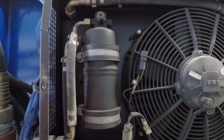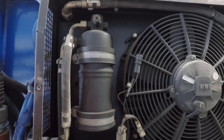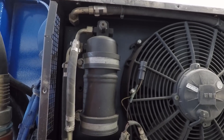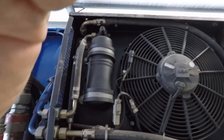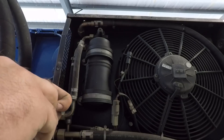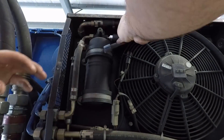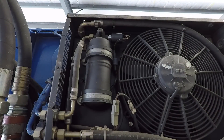So I'm going to install a new pressure switch, throw a vacuum pump on it, get it back down, make sure it holds vacuum, and then if everything checks out we'll go ahead and recharge the system. The switch came from Sedano America in Houston, Texas — great people to deal with. Anytime we've had to call for parts they go above and beyond; the parts and service department for Sedano is pretty outstanding.